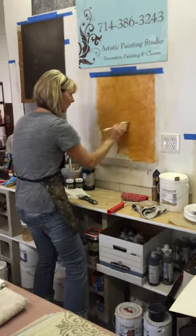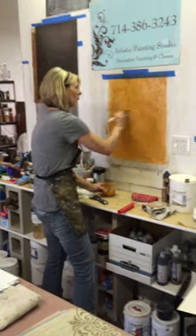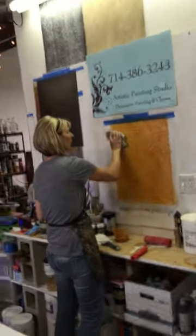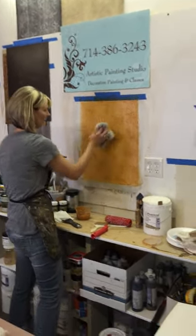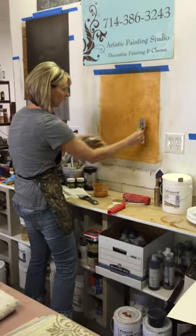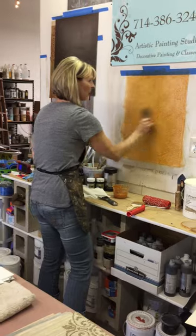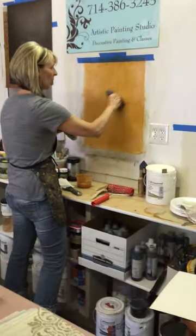I can also tell that I've got a new chip brush that I'm working with and it's left a few hairs behind, so I'm going to pick those out and get rid of that. Then I'm going to come through and just kind of soften a little bit of the excess glaze so there's not too much on the surface, just by pouncing. And then to create a lot of dimension and depth, take another trowel — a nice clean one — and I'm going to pull that glaze down into all the little divots that the ostrich roller created. This creates a lot of depth and dimension. I can see a few of those hairs, I'm just going to pick those out and soften out where I've had to do that.